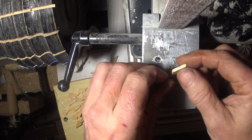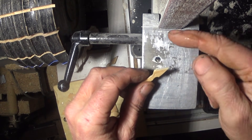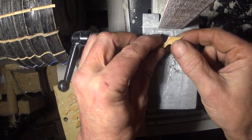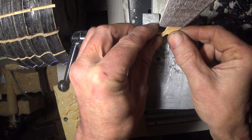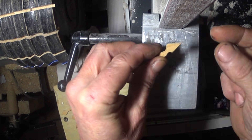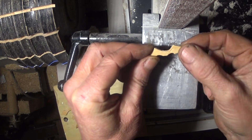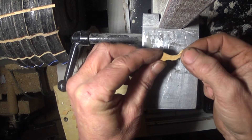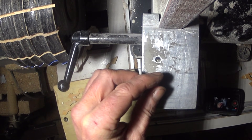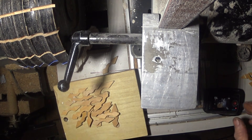The next step is to set this platen to 126 degrees to the belt, which gives me a 36 degree chamfer, and chamfer these outside points — the points that don't join together. They join together in the 3D star but not in the 2D stars. I'll put a couple of pictures up now and you'll see what I mean.